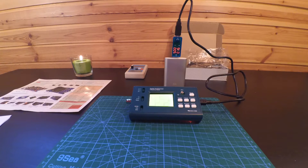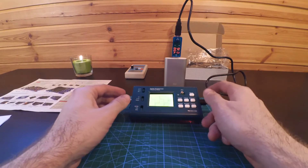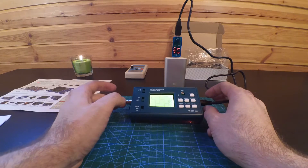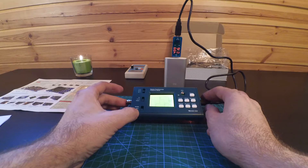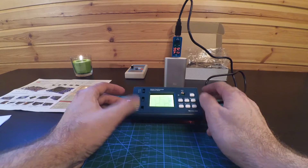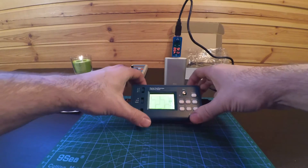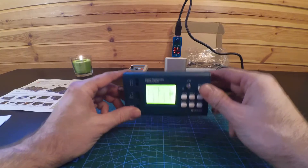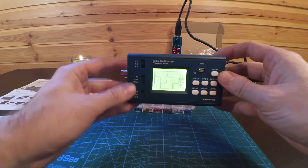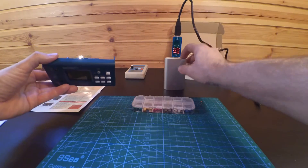Welcome back to part two of this DSO 068 oscilloscope. I'm going to focus on the adjustable compensating capacitors from the inputs, which I have broken both, as you can see in my last video. Right now I have a really messy input signal which overshoots totally because I have whacked both capacitors, so let's turn this off and get one off.